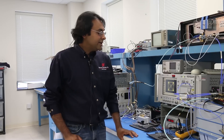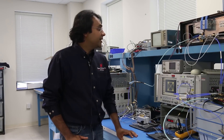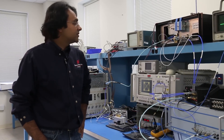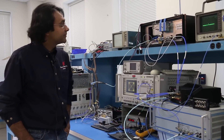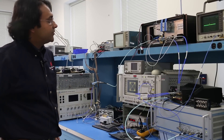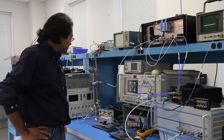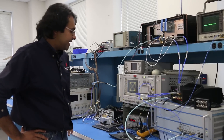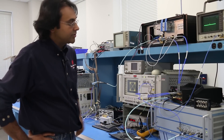The coherent LabBuddy can be used in a variety of test setups, including intradyne, heterodyne, and homodyne systems. Here, we are going to test this dual polarization receiver using a low-phase noise self-homodyne test setup. The setup starts with a low-phase noise CW laser, which we have developed internally. The output of this laser is split into two parts, one of which is routed through a polarization-maintaining fiber and acts as the optical local oscillator input to the LabBuddy.